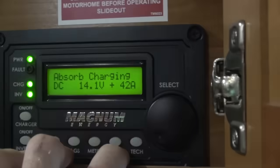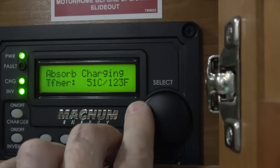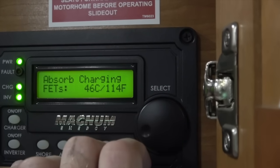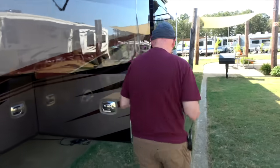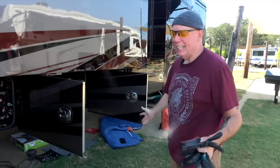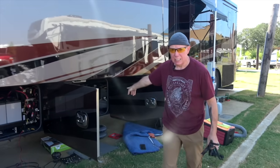The overheating was tripping the inverter to turn off — charging cycle, everything. So we had to replace these fans, and I figured I'd show you how while I'm doing it. On your console there's a temperature area you can check to see how hot things are. They should never really go over 170-something degrees, but ours did. I have two brand new fans ready to go. I've got everything pulled apart — the inverter is in this bay, and Brenda is going to film through the end bay.